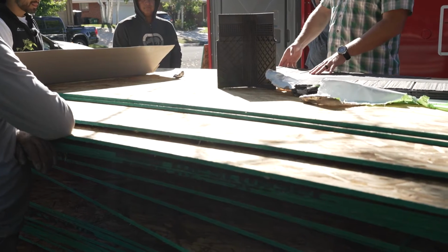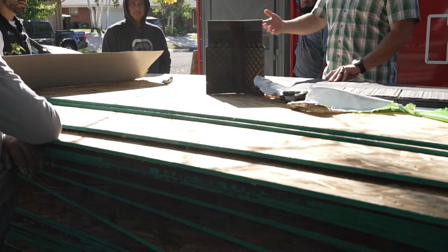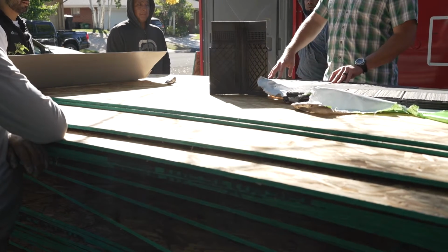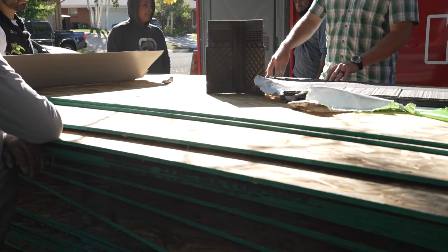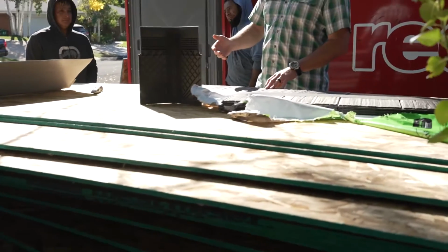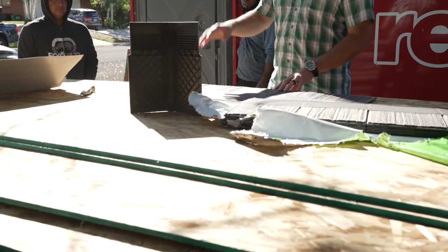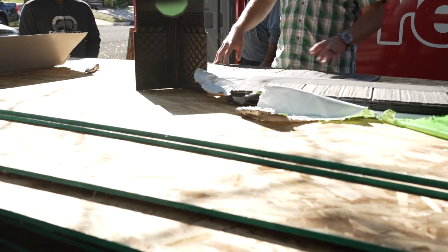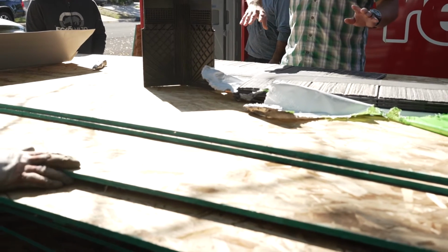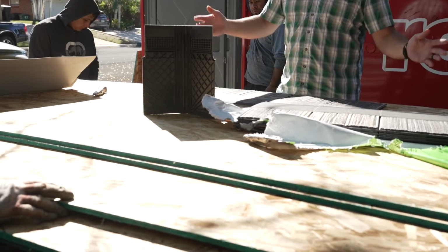Not much wants to stick to this, so we have 4 approved sealants. ABC will usually deliver you the SEBS one, the mule hide product. Hopefully that's what you have. Another, if you're in a pinch and ABC's not open, you can get at Lowe's, Home Depot, Ace, pretty much everywhere: the OSI Quad, just the regular version, not the Max. The Max doesn't stick to it.